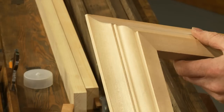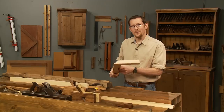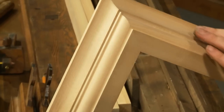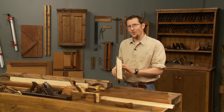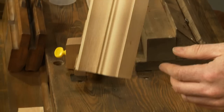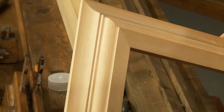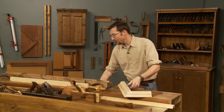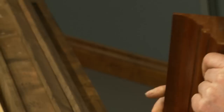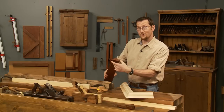This is a very simple thing to make — probably one of the easiest cornices you can make — and that's because it's made out of two parts. There's a good reason for making a cornice out of two pieces. Firstly, if you make a mistake with one part you don't have to throw the whole thing away, you simply remake that part. Second, rather than taking away a huge amount of waste, you're working on a very small area. Compare this to a moulding that started off about three by two in Sapele — you can see the sheer amount of waste taken out, and that's quite a lot of work.